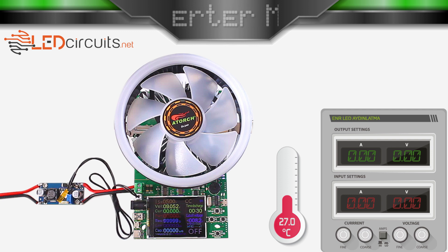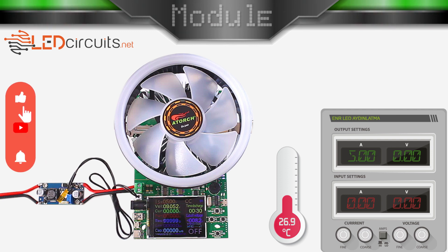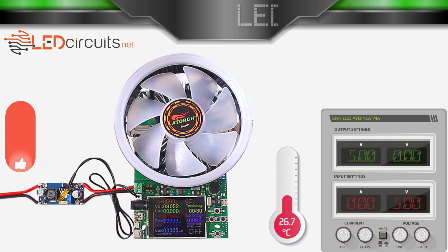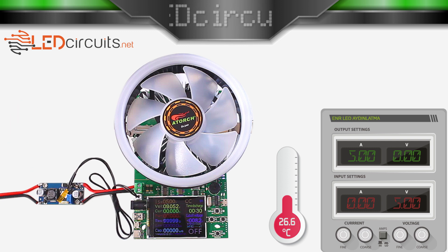In all tests, I will start with 5 amp current and then decrease the output current to continue testing. In the first test, I connect DC 5 volts to the input of the LM2587 power module. I set the output voltage to 9 volts and the output current to 5 amps. You can see the input current and voltage and output current and voltage on the power supply on the right side of the screen. In addition, you can instantly monitor the output current, voltage, and power with the screen on the power test circuit. I set the cutoff voltage to 8.2 volts. When the power test starts, the test will stop automatically if the output voltage of the module drops below 8.2 volts.